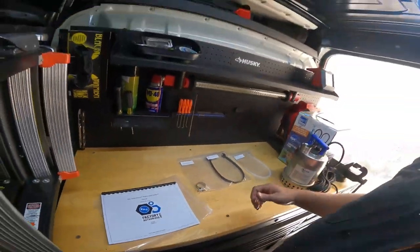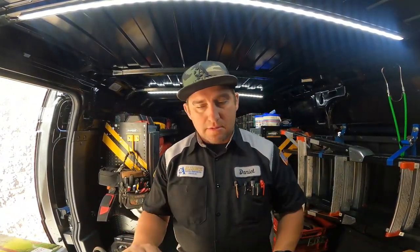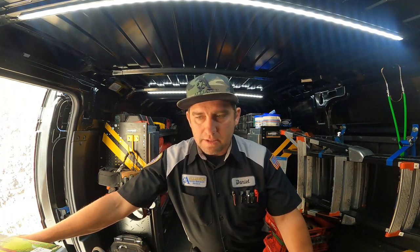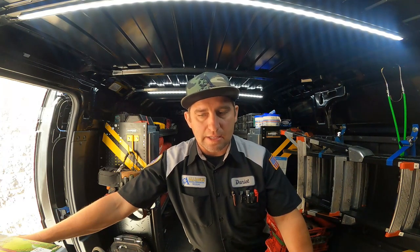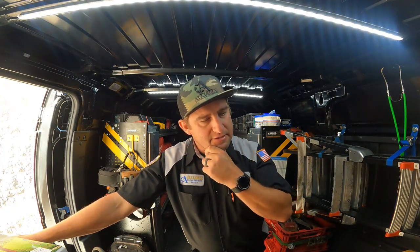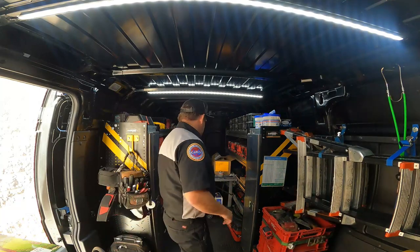I already pumped down the unit inside, and we're gonna get it up there and replace this pump, and so my customer will have the rest of the summer, no issues. These condensers have saved my customer a lot of time, a lot of money and water. The Trilliums, that's what these things are built for. In the wintertime, they use hardly any water. My pumps don't really kick on till the desired set point, which I think here is at 80 degrees. So they will kick on today, and it's about 76 degrees right now outside. It's gonna start getting hotter, and we'll probably almost get up into the hundreds today, about 98, 99. So I'm gonna put all this in a bag and get this up here.